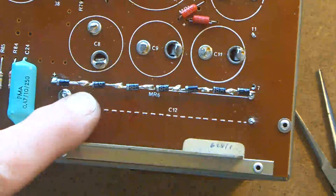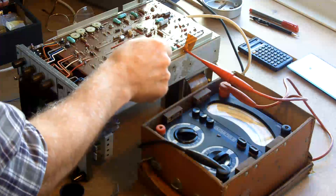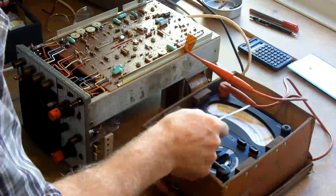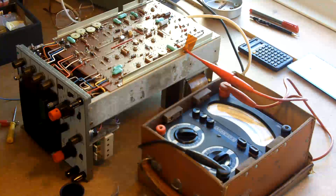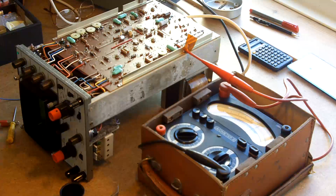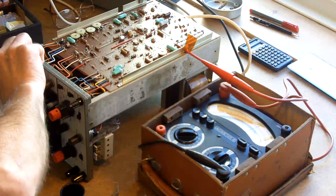That's the little assembly in place. Here we go again — I've got the meter onto the positive of the diodes. We're expecting 1.8 kV DC, so that'll put it somewhere about here — and no smoke please. Here we go, that's on there. Hey, look at that — that's 2 kV, just over 2 kV. Don't know if it'll come down when the tube warms up. That's good focus — and there, okay, we've arrived. We're back to where we'd expect it to be.